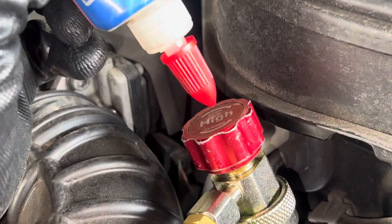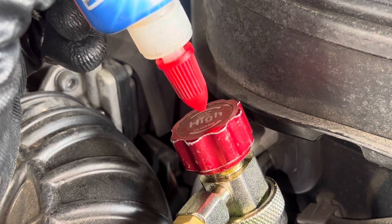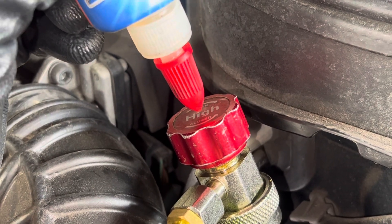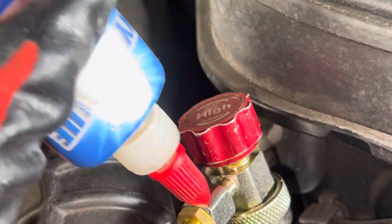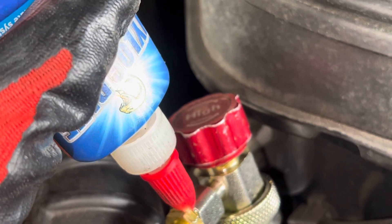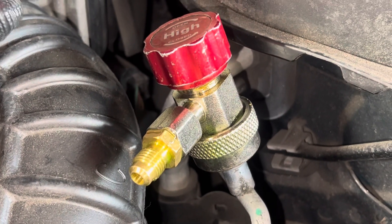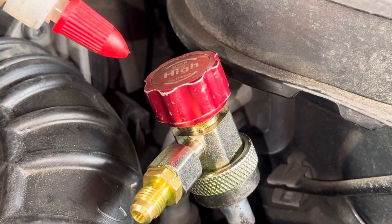The threads here — take off that cap, right where that little thread is — there's a little bolt or there might be a rivet that's permanent, and you fill that up with some Nylog and that'll stop the leaks there. You could back out this o-ring right here, put a little bit of Nylog in there, and tighten it back up on these two hoses. That'll give you a temporary fix, not a permanent fix, until you order your new Yellow Jacket couplings. See you guys.